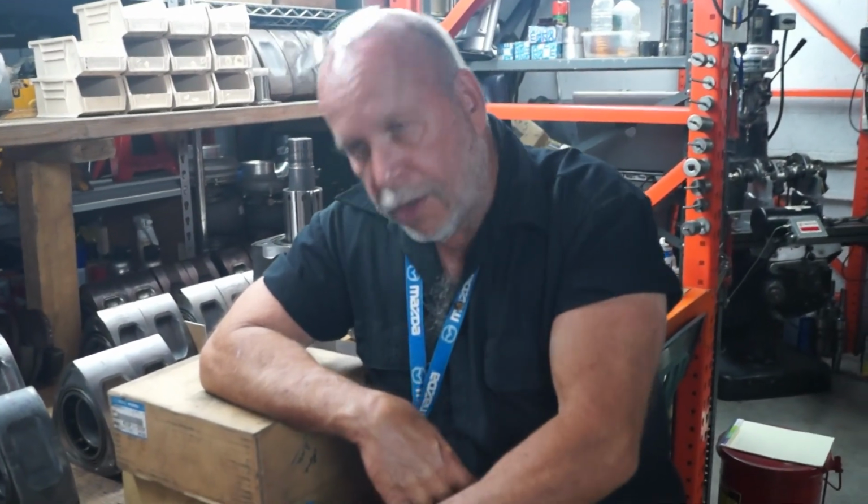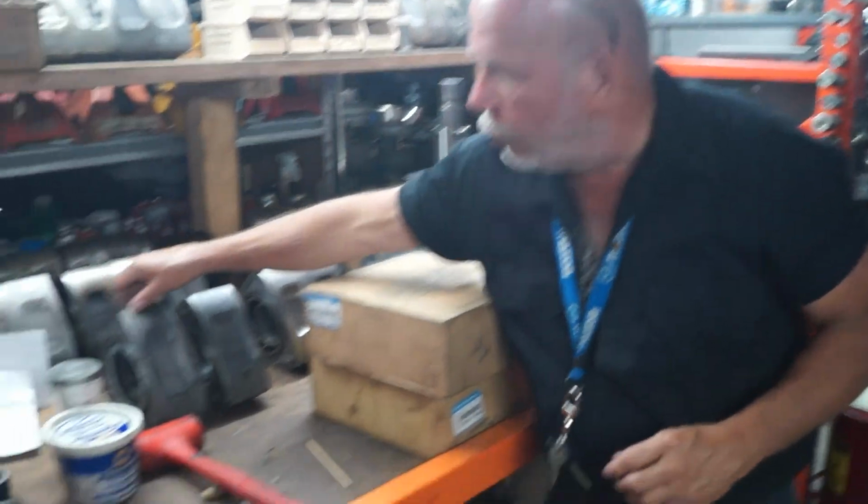After this experience, a stock RX8 rebuild, forget a performance RX8 rebuild, that doesn't exist. All you can do is try to regain some of your internal drag and some of your parasitic losses by optimizing what is there, like by balancing, by cutting the grooves and putting in some RX7 seals, the normal tall ones, instead of the tiny little RX8 seals that, in sheer volume of material, are going to be 10 times stronger.